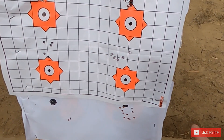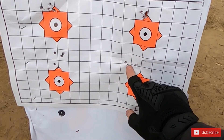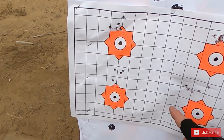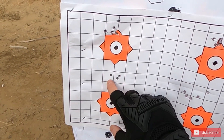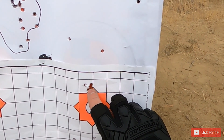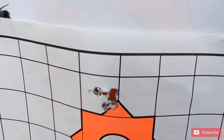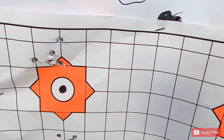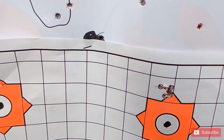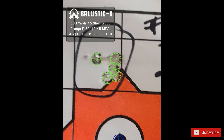Let's look at the groups. This is the Hornady Match that I reseated to match my chamber's ogive. First loadout, second loadout — five holes there, all four touching and one slightly to the left. This next group was 0.1 grain higher. That's where I found my load. Now it's your turn to find yours.